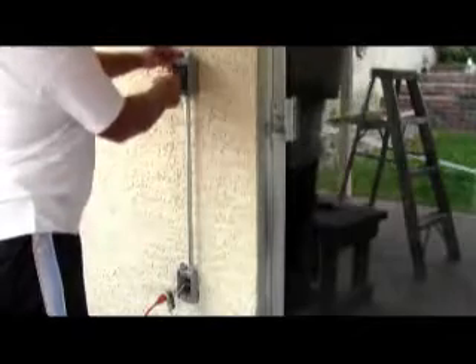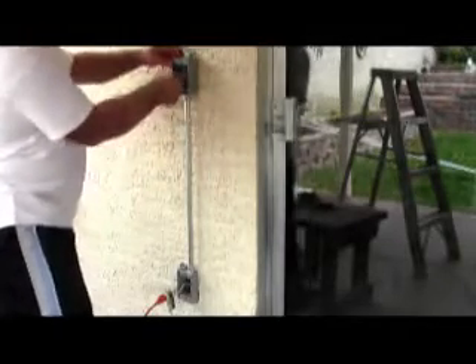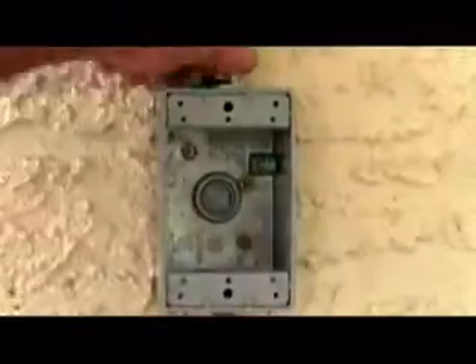The center of that beam is right about here, which means we're going to drill a couple holes here to mount that. We're now going to run our final piece of conduit from here, put a special kung fu whammy bend on it, and come straight down to meet the switch box right there.